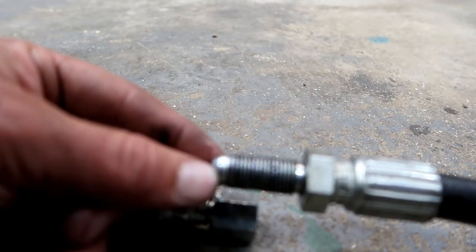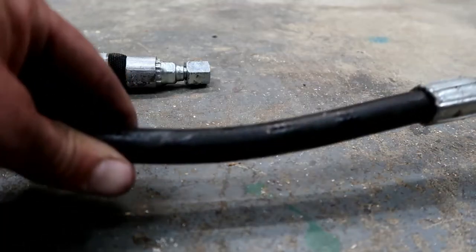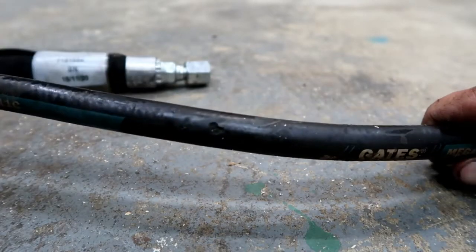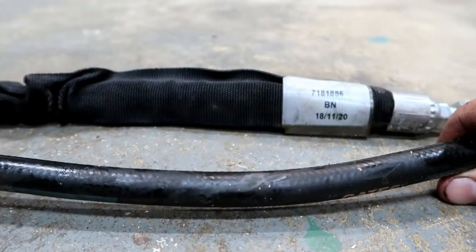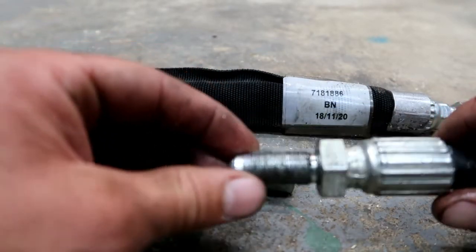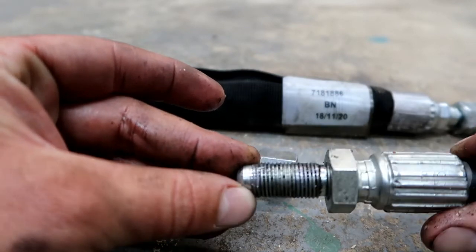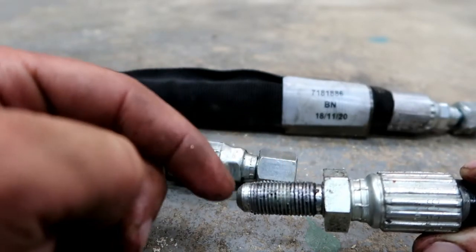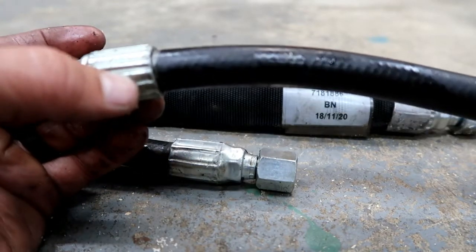When I went and got the new O'Reilly hose made, trying to screw it back on it wouldn't go because the threads were bent. So what I did is I screwed on the O'Reilly one as far as I could until the kink, then took a hammer and straightened it out as best I could and threaded it on the rest of the way. That held line pressure pretty good — leaked a little bit but not too bad. Another reason I needed to fix this: in just a few hours running, we already got chunks taken out of the O'Reilly line from running in the woods without that protective cover. So I'm going to keep that as a spare. Taking off the nut was a pretty big task — we trashed the threads pretty good, but that actually is a pretty straight end. I probably could have used a tap and die set, but at 30 bucks for one hose and 50 for the other it wasn't a big deal to just replace them.